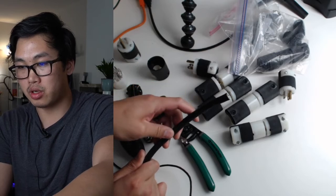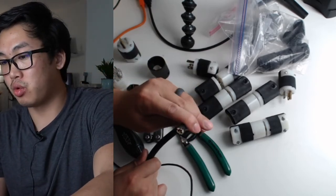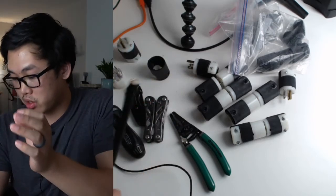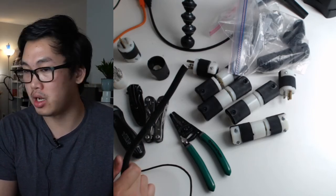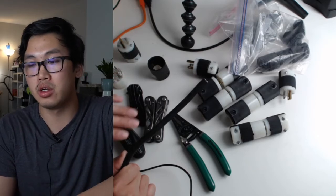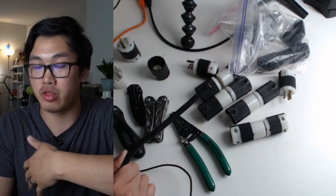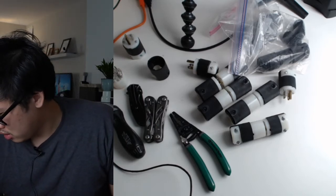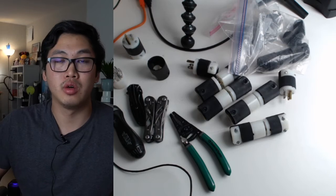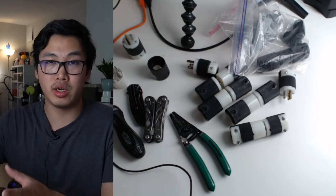And you can use these outdoors, so you can use them to power things outside, and because the wire is so thick, it'll carry the entire current all the way across. Because if the cable is too long or too thin, you'll have what's called line loss. So after a certain amount of cable, usually they say about 150 feet, your lights will start dropping power. So if you have a 2K light or a 1K light, and you have like 300 feet of cable, it's not going to give you the full wattage, right? So a lot of times when you're running cable a long way, you'll have gang boxes or lunch boxes that'll help get the power to where it needs to go and the full amount of power.